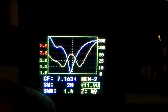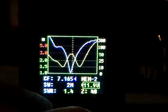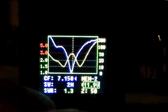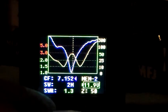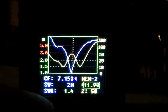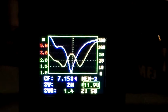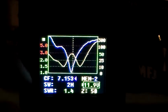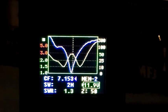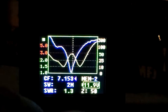So really this is quite broad — you could tune this once. If you wanted to talk to the Americans on 7.151 for example, or wherever it is they use — I can't remember now, someone told me the other day, it's a fairly common frequency. So we've tuned the ATU for 7.093, we've got a 1 SWR, we've gone up the band, it's now 7.153 and we've only got a 1.3 to 1.4 SWR, still showing 50 ohms. So it's pretty broad tuned really.